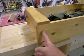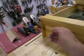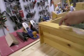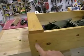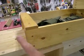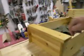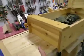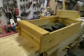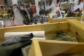These are just dowel joints on the ends, and then you put a handhold here. That's all glued. These are doweled. There's screws here. This dowel joint, that's actually a little dado right there on both ends. So it's tremendously resistant to racking this way. The bottom's glued in, and then the top's pinned across, and these hang out just because of this piece. So it's just a rectangle. It's just a box, a simple rectangular box. But it's just incredible the amount of stuff that this will hold.